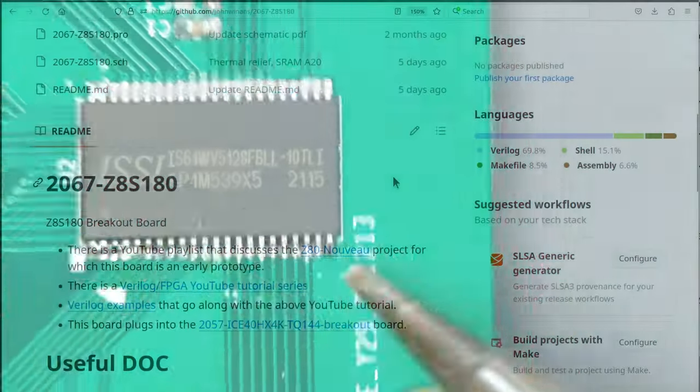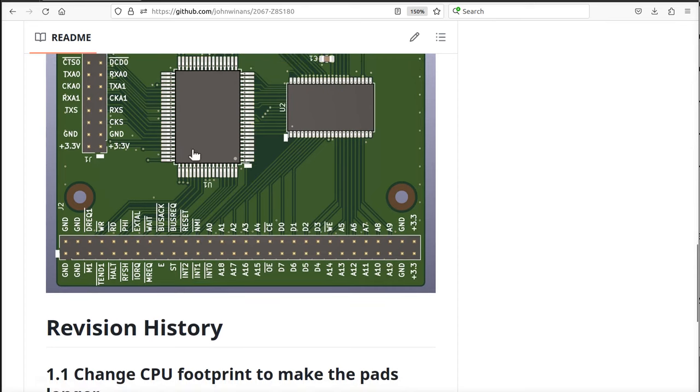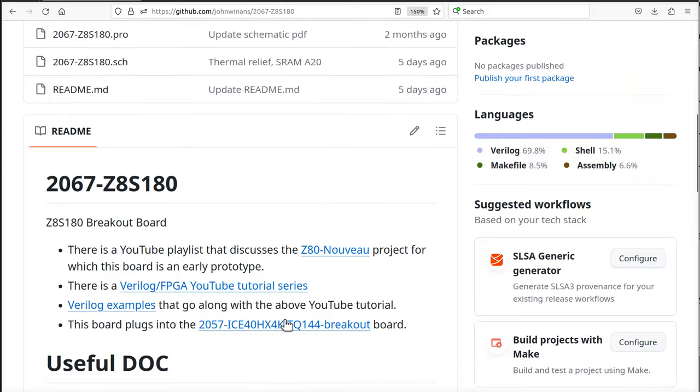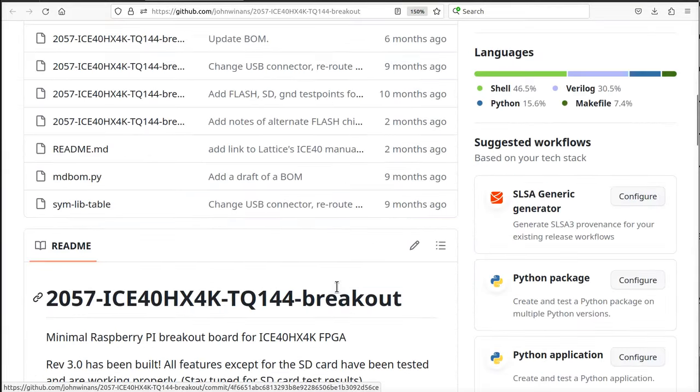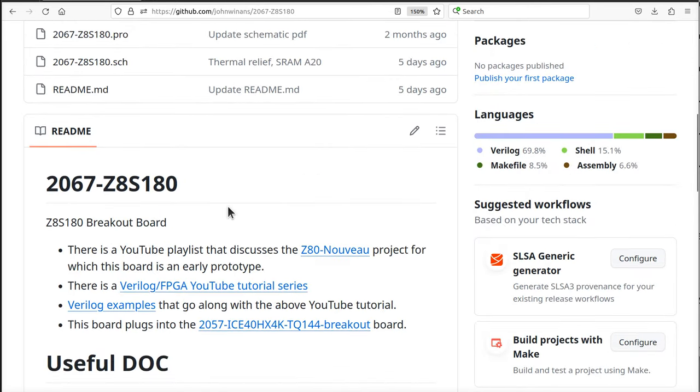All right, so we're testing out my Project 2067 board. It has a Z8S180 chip, an SRAM on it over here, and it plugs with a connector here into an FPGA breakout board, which I call Project 2057, and should be linked to right here. If you want to find these parts, look at the schematic and follow along at home. I'll put links to both of these repos in the description below the video on YouTube.